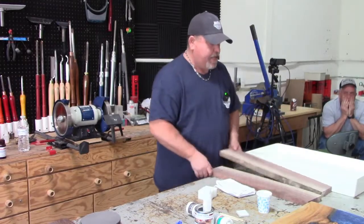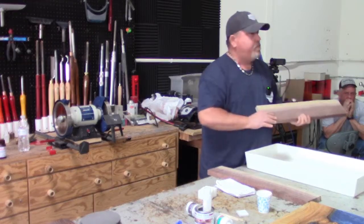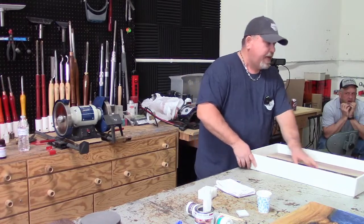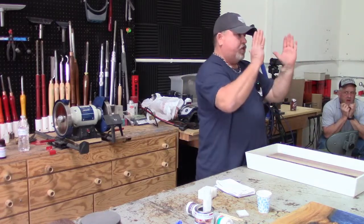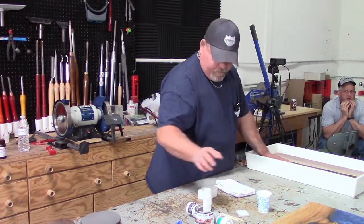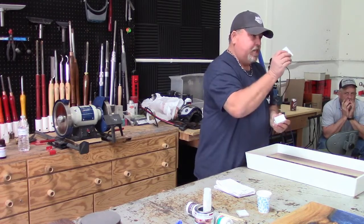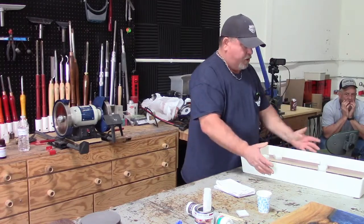So let's start with that. Basically, you take your wood — you want it to be already surfaced top and bottom because you don't want epoxy leaking underneath. You cut them to size. These forms are made at a five-degree angle so that when you go to demold, it can actually fall out rather than being straight. You do get a little epoxy along the edges, but wood floats in epoxy, so you've got to hold it down. You can use HDPE blocks or clamps.